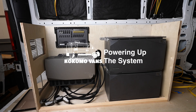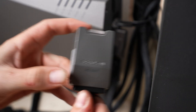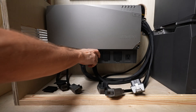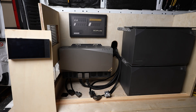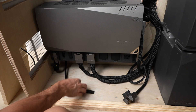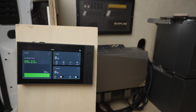Alright, now it's time to power up the system for the first time. Make sure your two CAN bus connectors are already plugged into the power hub. Then plug in the DC out connector and the AC out connector. Now plug in your batteries and then hold down the power button for 3 seconds. Once the system is running you can plug in your inputs from left to right: the alternator charger, solar charger, and shore power. Before you turn on the AC and DC power, make sure you don't have any loose ends that will get energized. To turn on the AC and DC power, press these little toggle buttons.